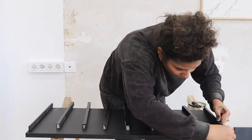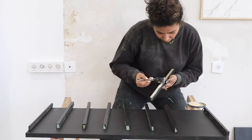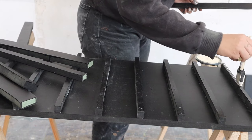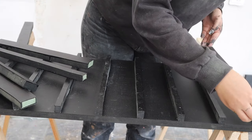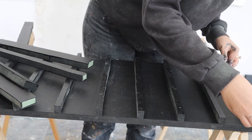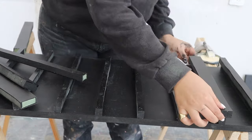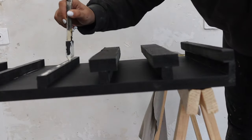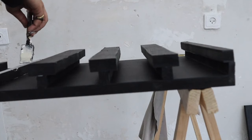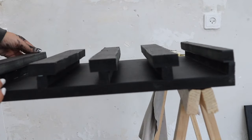For the top part of the cabinet instead, we want the glasses to hang upside down. And how are we gonna do that? That's simple. We created some volume where there's emptiness inside so that the glass can get stuck inside from the bigger part that is the bottom of the glass. Basically, we created first the volume of 1.5 centimeters, and then on top of it, we are applying the 4 centimeters ones. You can now totally go and create your box.